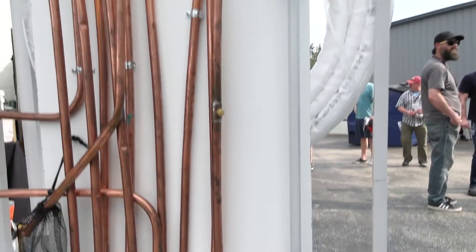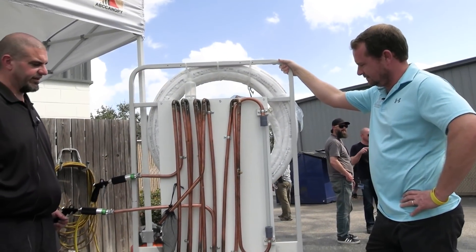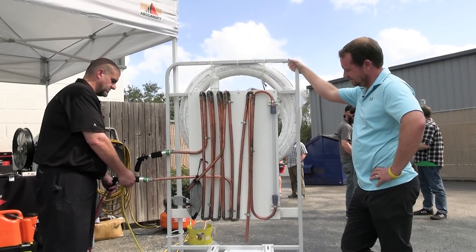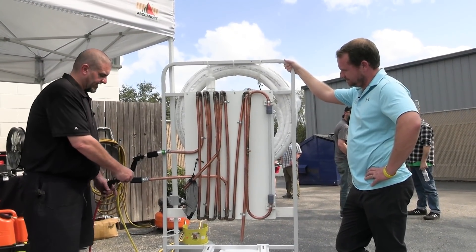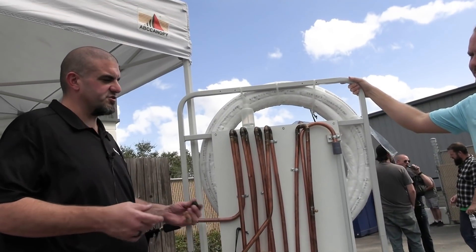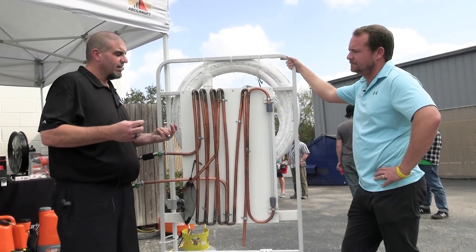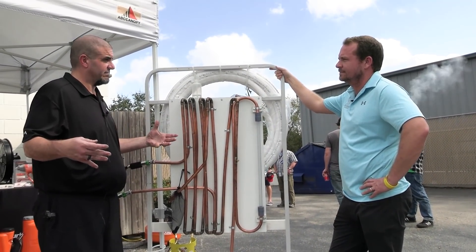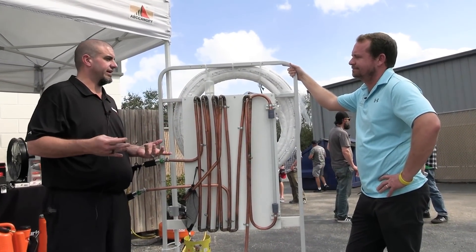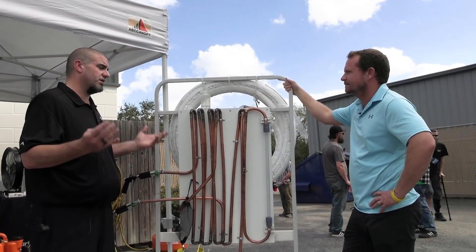Once you've pushed that pig through the line set and cleaned out the oil and gunk, you're probably going to want to send a few more through just to clean it out, and you can do them one after another — it cleans that line set every time. A lot of people have asked why we call it a pig. That's actually an industry term from the oil and gas industry. They have pigs anywhere from three inches up to eight feet in diameter to clean large pipelines, sending them down the lines to do the same thing we're doing, just on a much larger scale.